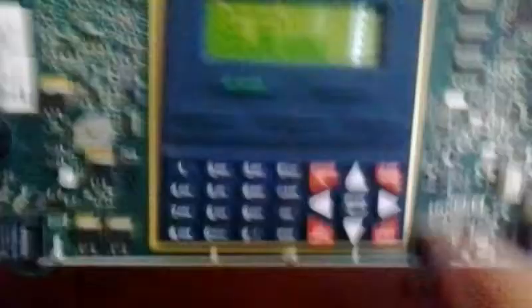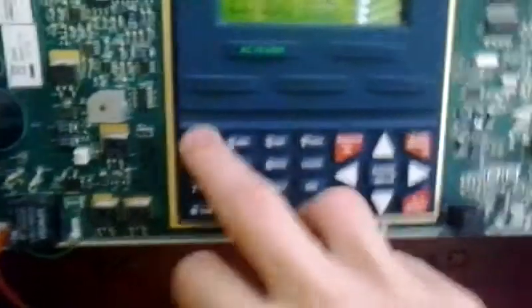So we're going to go to programming now. Hopefully this detector won't go back into alarm. We're going to go to read status, system point — let me zoom this in for you. We're going to go to detector — it was .001 last time. We're going to go back to chamber value: 1348. It went up by one.